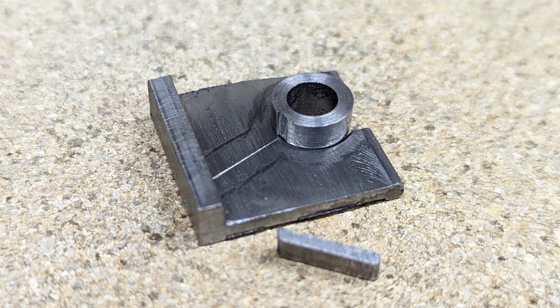Because it's quite messy with the flux, and there's lots of high temperatures and flame involved, I don't really like videoing when I'm soldering, so unfortunately I'll just have to run through a series of pictures. To start, I've separated the two bearings from the stock, and just in front of the bearing you can see the little rib that I've cut from some 1.6mm mild steel. To avoid getting solder all over the part, I've drawn a pencil line around the joints — this should stop the solder from spreading.